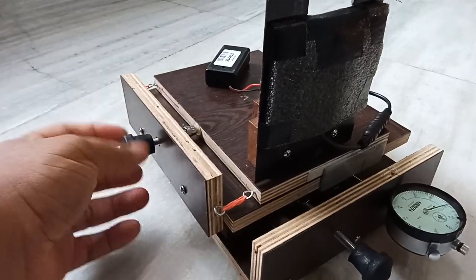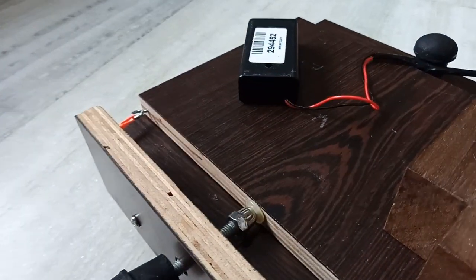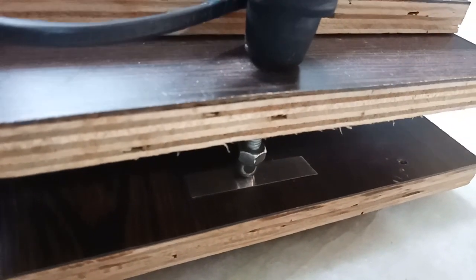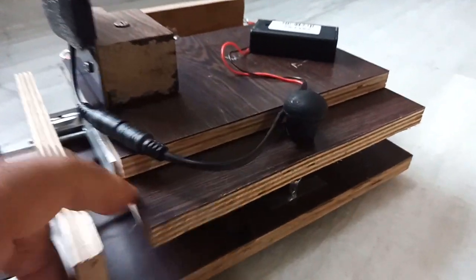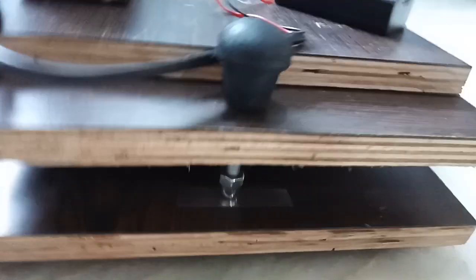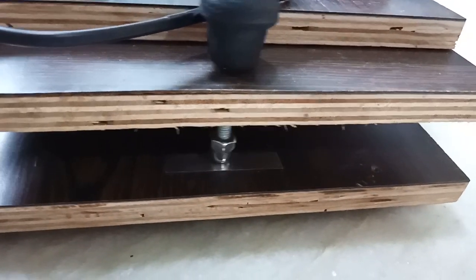For the left and right lateral motion I use this bolt, and I have also used a dome nut — that's what this is called — for clean, clear motion. The dome nut is used here and also here for precise alignment of the knife edge. As I mentioned in my previous video, alignment is not strictly required because this is a moving-source tester which doesn't need alignment with the slit, but I still decided to include it. There is a steel strip here so whenever it moves back and forth it won't damage the plywood board.